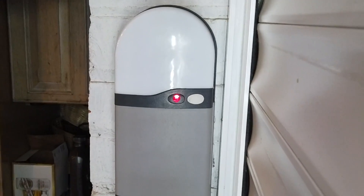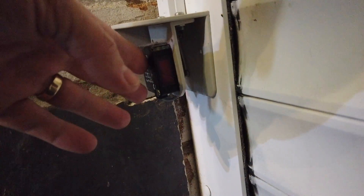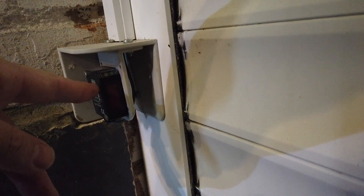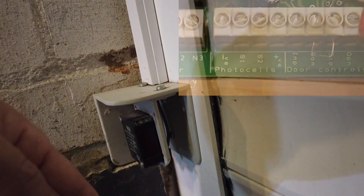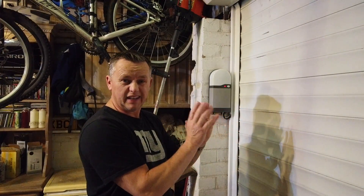This light is flashing - generally when you've got the full light flash that means something is blocking the photo cell. This is your photo cell; these are all very much of a muchness between all the different manufacturers. When something breaks the beam going across from here, reflecting off the reflector on the side, it will trigger the control unit to stop. These are only powered with three wires: positive, negative, and a switch. All it's doing when clear is putting a 12-volt feed down the switch wire.